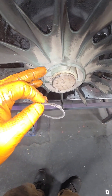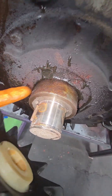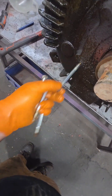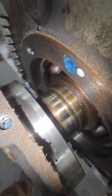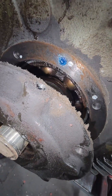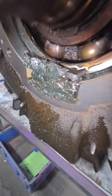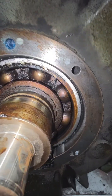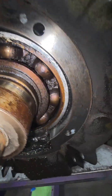We switched over to our opposite drive end. We've got a little snap ring to remove our plastic fan — I really dislike plastic fans, but I get it. We've definitely got some grease and oil leaking out of this end just like the other. Same process — we're going to remove those bearing retainer bolts and remove that outside bearing retainer. Looking inside, we can see we actually got some fresh grease. Blue grease going in that hole, out this hole, into that hole — it comes out the backside, goes into that back bearing retainer behind the bearing, pushes the old grease out and down into the drain. That way the new grease is pushing out the old grease. However, I feel like people don't really go through this process until it's been too late. This is just a standard ball bearing with rolling balls, not the cylindrical rollers like on the drive end.